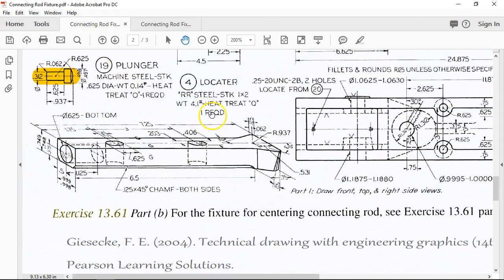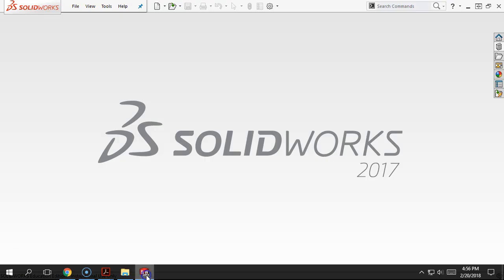Let's get started on the geometry — I'm going to stay with the top profile. When I looked at this, the 1/8 inch by 45 degrees — to make that chamfer is still a round tool, either a chamfer tool or a drill mill with a 45-degree angle, 90-degree included angle. As I come up to that point where it shows 0.75, that little bit of cup radius they're showing, I need to include that. This will actually terminate at about 0.875 — I'm going to add in the width of the chamfer and then we'll do another revolve cut to put that little scoop in.